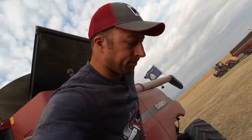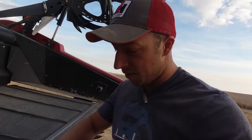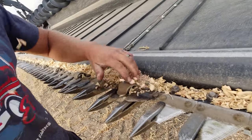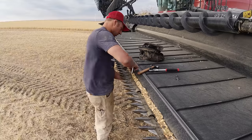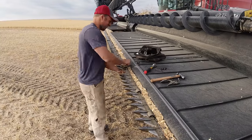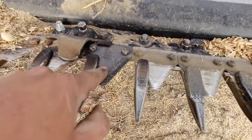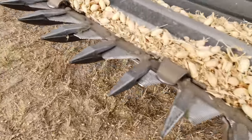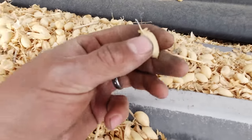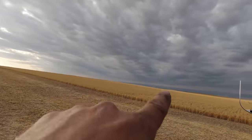We're trying to get it done before the storm hits. Fortunately all the wheat's off. I don't know how these chickpeas are going to handle rain and snow, but we're just going to keep going until we get stopped and then pick up when it all dries out. Heard some squeaking — usually it's something to do with the feeder or the cutter bar. I can feel the heat radiating from it — great way to start a fire. Let's take it apart and put a new one on.